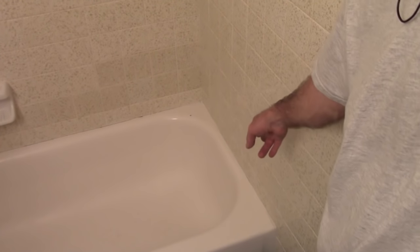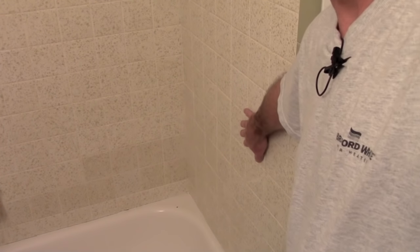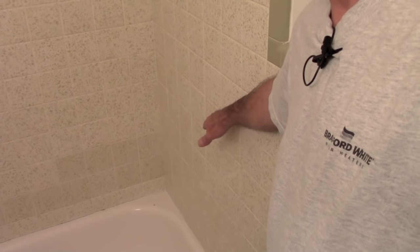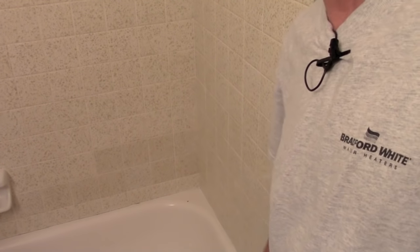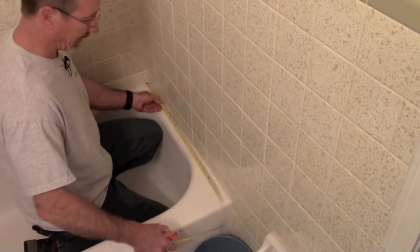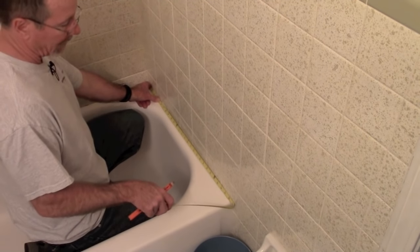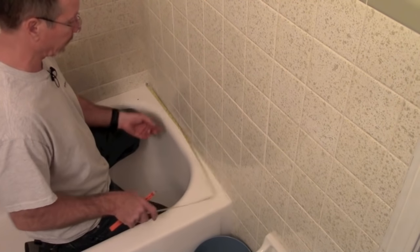As you can see, this is the bottom of the tub. We're going to put one bar on the end, positioned up about here. I'm going to try to center it on the tub. You will also need a measuring tape. So the first step is to find the location for the bar. This tub is 28 and a half inches from the tile corner to the edge, which means the center is going to be 14 and a quarter inches.